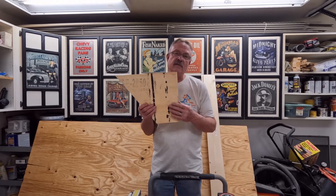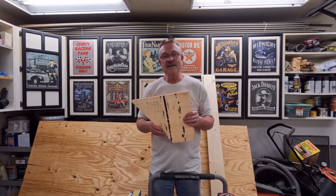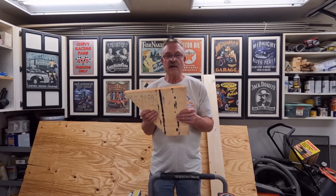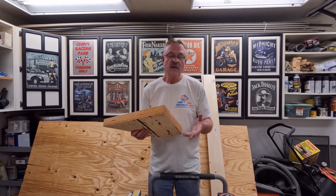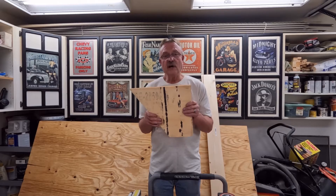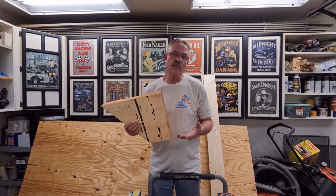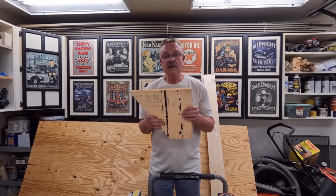What I'm holding in my hand here is 11 and 7⁄8 by 1 and 3⁄4 inches. When you buy dimensional lumber at the lumber yard and it is not a custom order, it will always come as 1 and 3⁄4 inches. The reason for that is this is used for headers a lot of times. If you use 1 and 1⁄2 inch material for headers such as a 2×12, then you have to put a piece of half-inch plywood in between to get it to 3 and 1⁄2 inches — the same thickness as the wall. These LVL beams being 1 and 3⁄4 inches, you can double two of them up and that takes up 3 and 1⁄2 inches with no plywood in between. It's not that the plywood makes things weaker; however, if you have solid material all the way through, it is actually stronger.